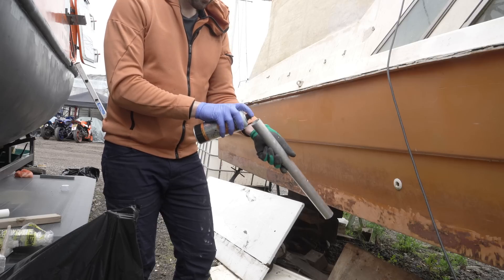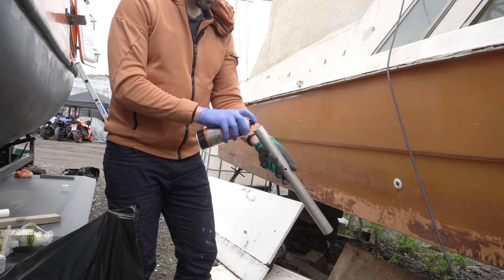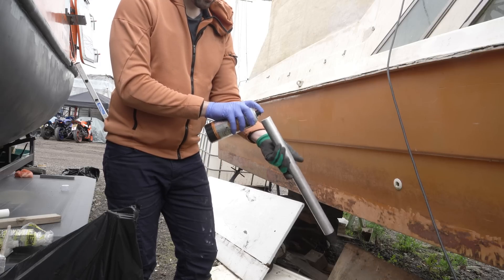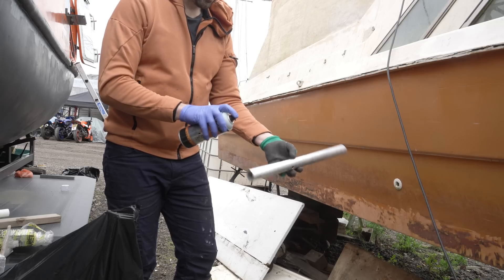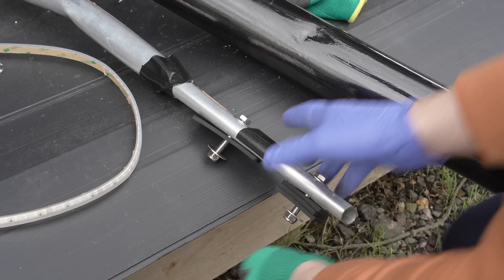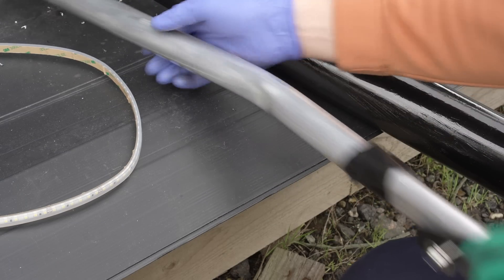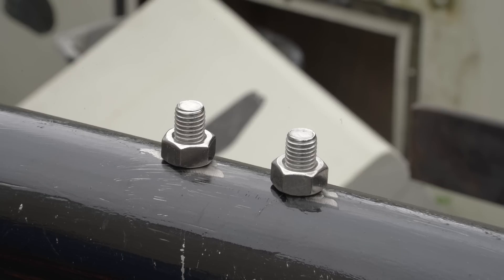I did grind this section off, but no sparks — so no fun. I need to properly coat this aluminium tube to stave off corrosion. Why not steel? I didn't want the top of the mast to be unnecessarily heavy — I could have used fibreglass, but I didn't. So this acid-etched primer is the first step, then black once again like all its compatriots. This bent section was supposed to keep the wind generator vertical when mounted on my slanted Arctic sledge rear end. And here's the LED — I've closed off the cut end with a blob of sealant and some heat shrink. With a doleful final view of the nuts and slowly curing JB Weld epoxy within the mast, I bid you farewell — but not for long. Bye.